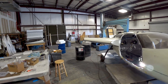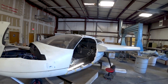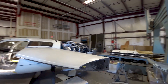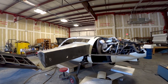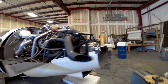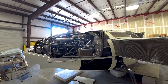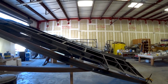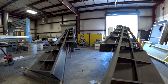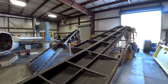Back out in the shop, we've taken the wings off the fuselage and the foreplane wings have gone back into their fixtures. The wings are ready to be closed out — that'll be happening soon. The cowling is mostly done, so I can get back and do a few things in the engine now that I've got easy access. Next week I'll probably be pulling the re-drive out and putting those new oil rings in. The wings just need the lower skins bonded on and then they'll be ready to have the ailerons and rudders fitted.